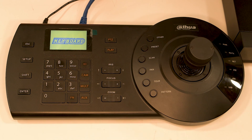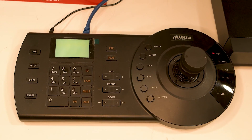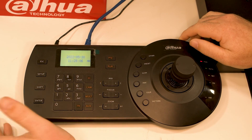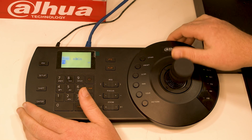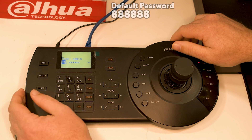So we'll show you exactly how to add a recorder and a PTZ by making sure that the IP addresses are correct and by typing in correct passwords, making sure everything just matches with your recorder and with your cameras passwords as well. So that is busy booting up. Once we've got that loaded, the device is fully powered on. First things first, we need to make sure once we start getting everything set up is to get in your password. So your default password is six eights. Go enter.